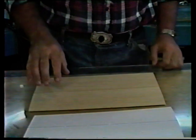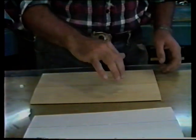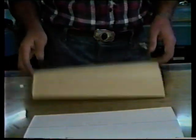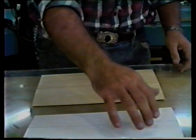Now, I just got done spraying these outside. What I do, I take my fingertip, and when I can pick this up, you can see how sticky it's getting. Do a little test, make sure it's getting good and sticky. I guess we're waiting about a minute or so. Of course, I got the glue on the core too. The core, for some reason, takes a little longer to dry. Probably because we got more glue on it. Put a good healthy coat of glue on it.